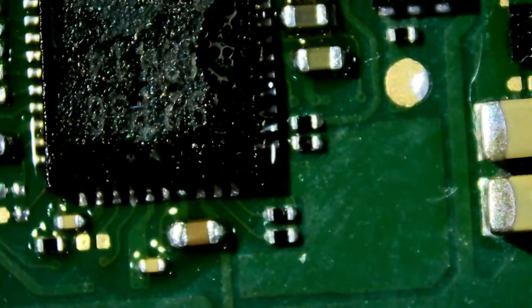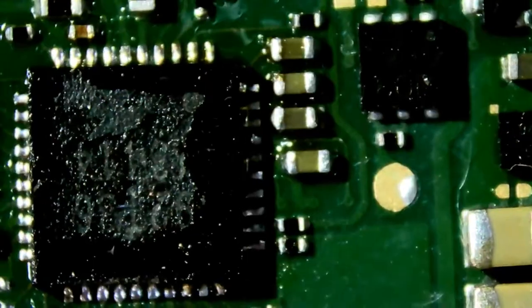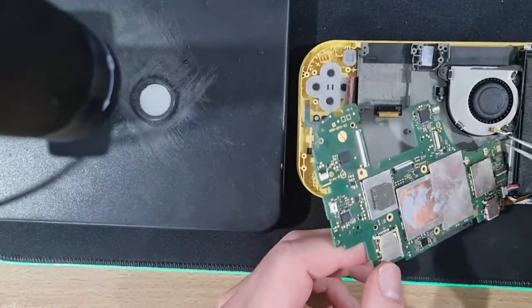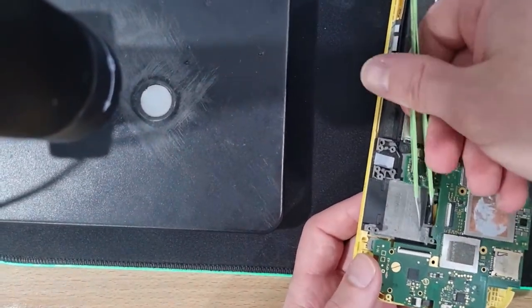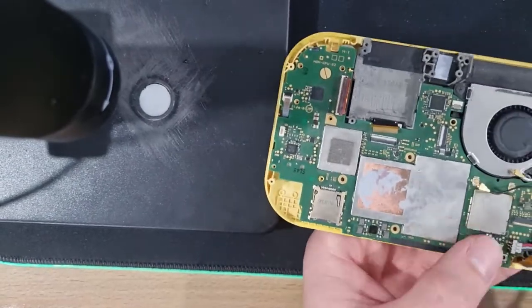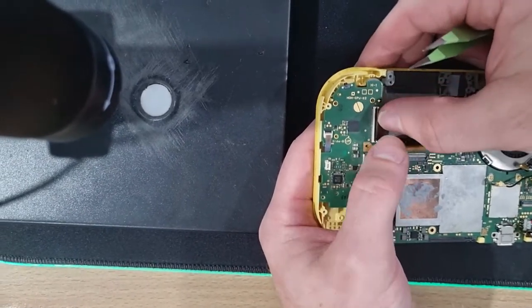I'm just going to run around the edges of the M92 with the solder and iron as well, just to see if that helps. Making sure there's still flux on there too — definitely need flux. So it's about all done. M92 solid around the edge and the USB-C port all sorted in place. I was able to plug it in and I got 9 volts and 1.1 amps. With it drawing 1.1 amps, I'm going to plug the rest of the connectors in and hopefully see if we get something on the screen. If so, I'd be very happy indeed.